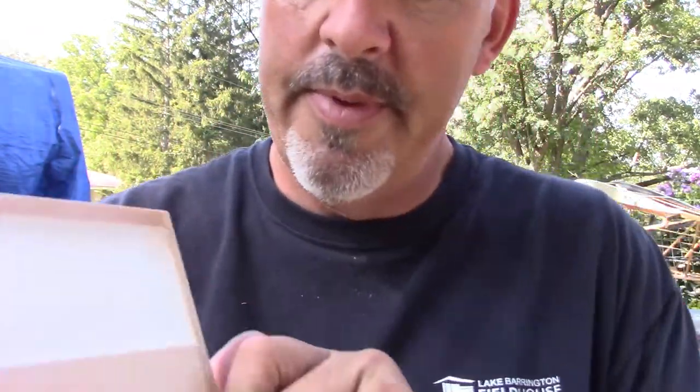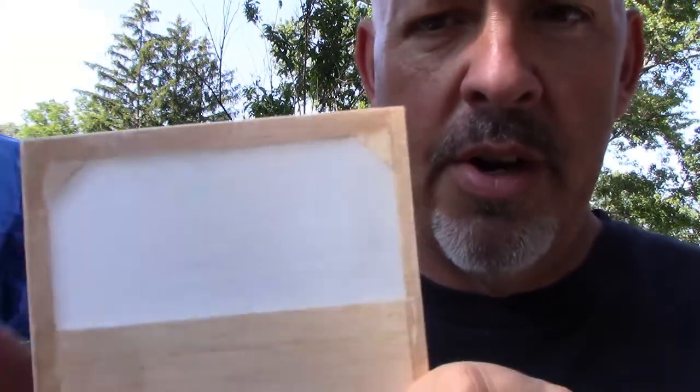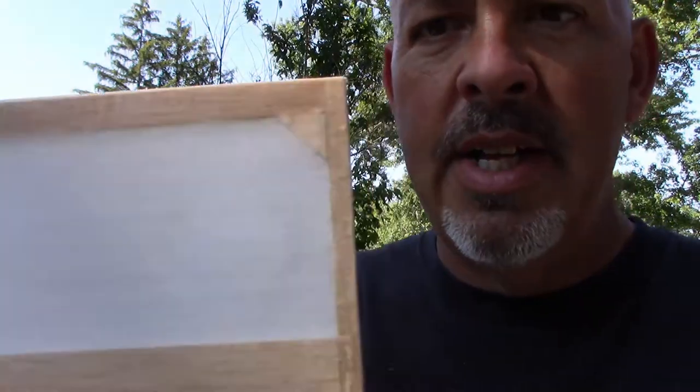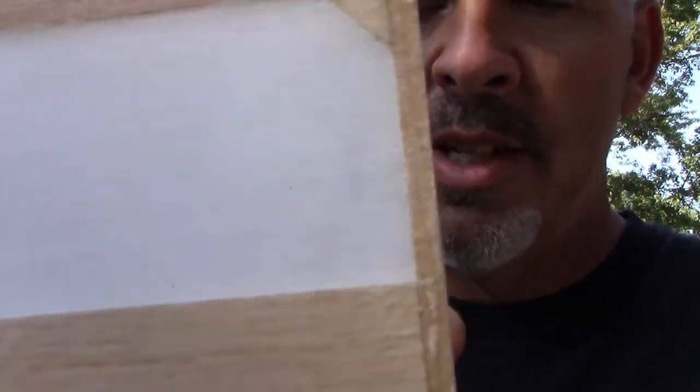Alright. I put one coat, the first coat of nitrate dope went on. Then I put another coat on. Then the third coat and the fourth coat had the talcum powder in it. I don't know if you'd be able to see it. The first coat, you can see where the weave wasn't sealed yet. You can still see through it. This one is looking pretty good just the way it is. You probably can't tell through the camera, but if you were here in real life, you could see it. It's got the drum sound now.